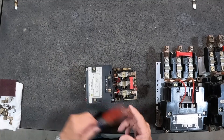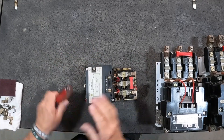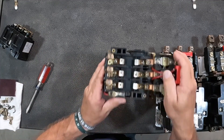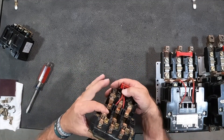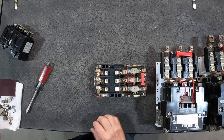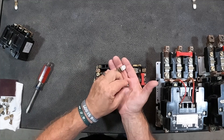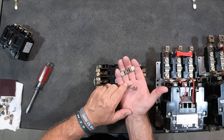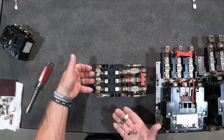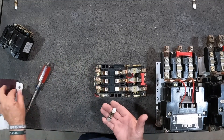Loosen those up — we've already loosened up your screws. You've got two of them in the corner here. Spin it a little bit, make sure it's not dragging. Now we want to pull the head completely off of this, set that one to the side. We'll look at the contacts inside. I'll show you something a little bit different about these — we've already got them pulled out. You'll notice that these two are a different shape. One's got a hard bend in it. Make sure when you're going back in that this bent one goes in what we call the line side, or the top of the starter — in the very top up here. Pay close attention to that as you're taking them out to do a little cleaning.